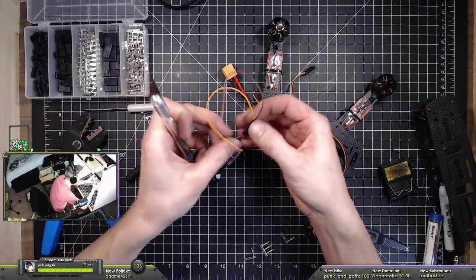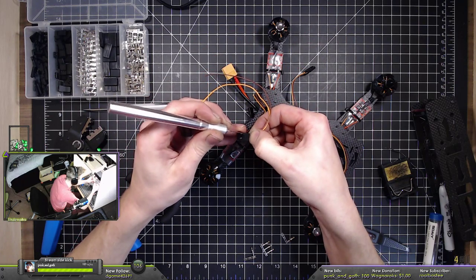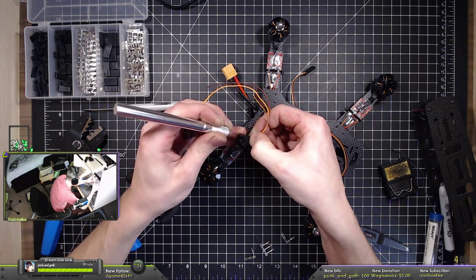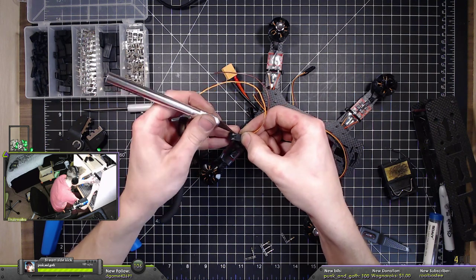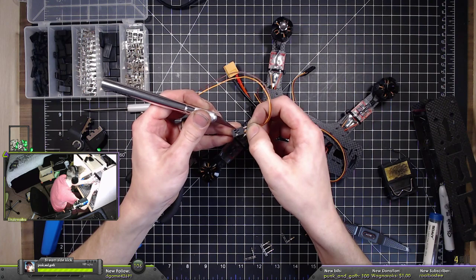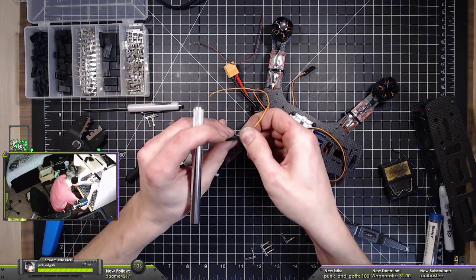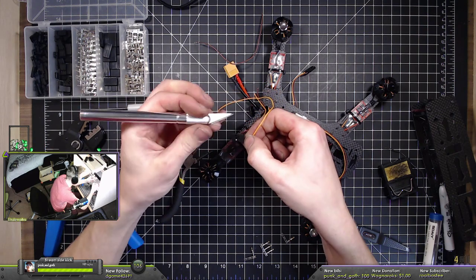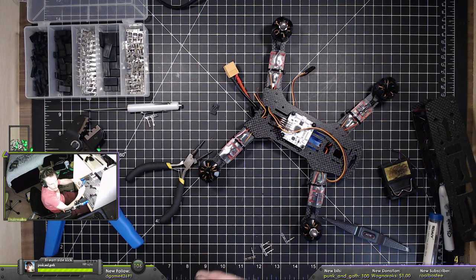Depin these by picking up the little tab. Stick the razor blade down in there and just give it a tiny little twist to lift that tab up. Once the tab's lifted up, then we can pull, get the wire out. Lift the tab, pull the wire. Oh, snagged it, so there it is. Junk wires. See you later.